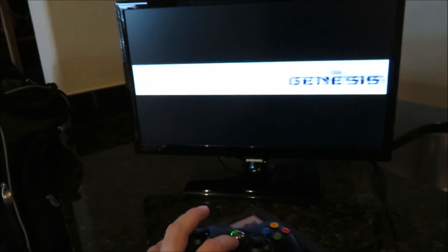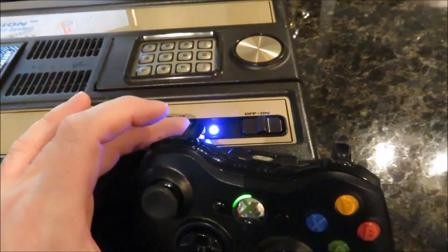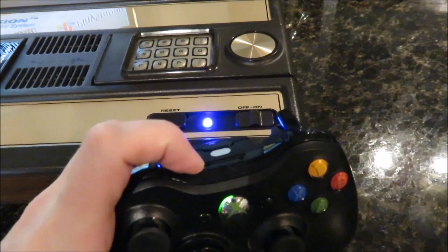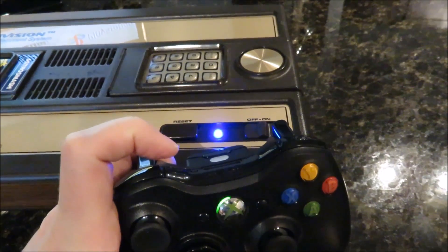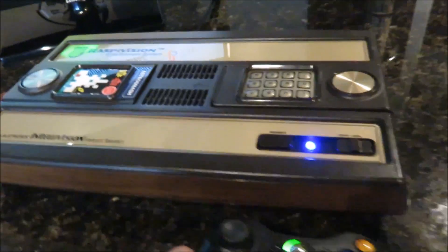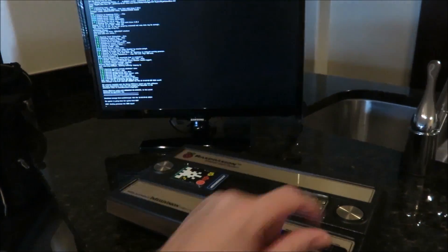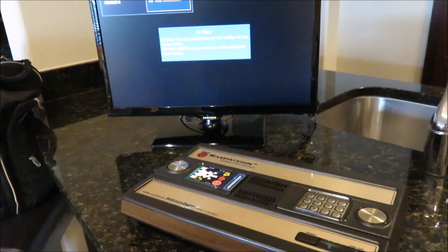I have all the systems. If you need to sync an Xbox controller, you can do that. By pressing that button, it goes into sync mode, and pressing the sync button on the Xbox controller syncs it right up. So that reset button has now become a sync button, so I don't have to open the system up to sync. And when you're all said and done, you press the off switch, and it shuts down the Intellivision properly and kills power. That's the Mouseberry circuit.